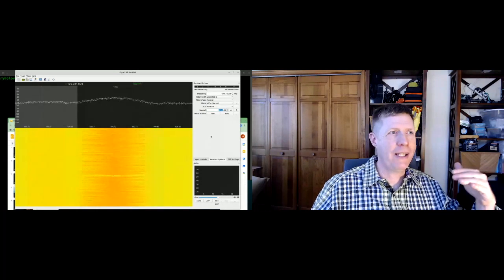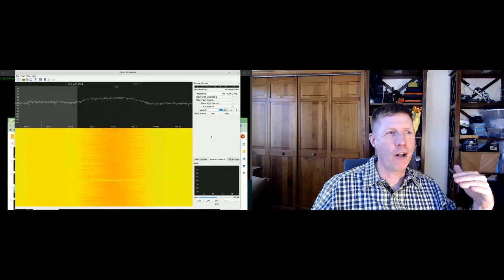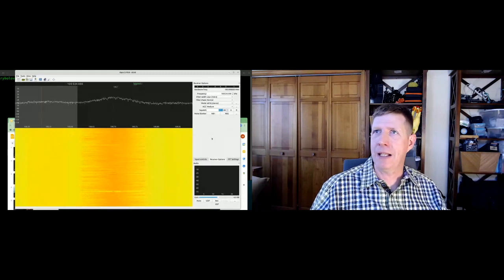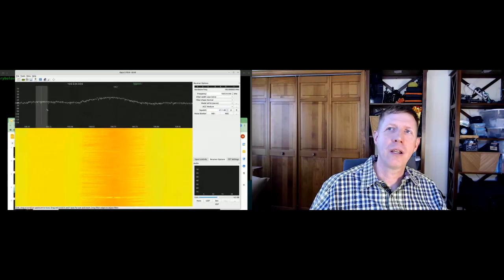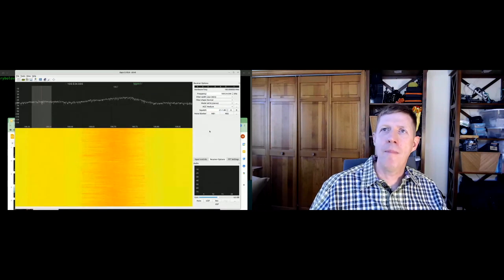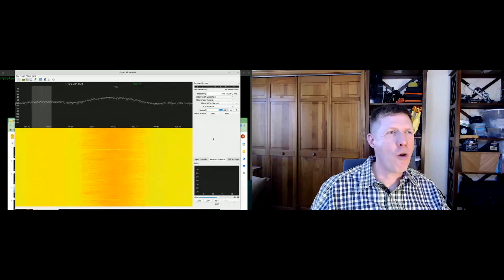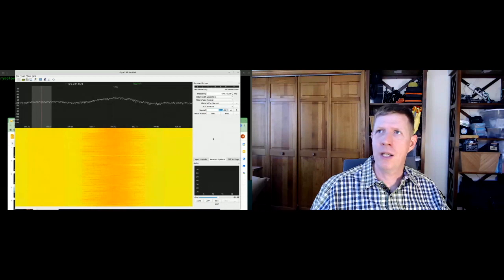That basically sets the noise floor. Anything below that, don't play it as a sound. It clips anything below that level. As you change your width, that squelch also changes. There is a shortcut, which is this little A here. It sets the squelch to the current level plus a little bit. If I bump it down a couple of times, I'm back to hearing static. So bump it up three or four bumps above where you can actually hear that noise.